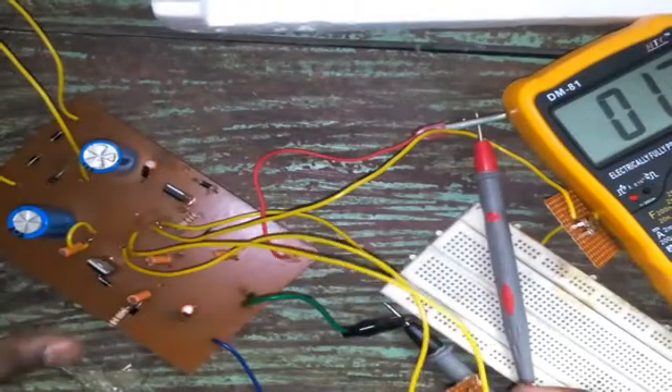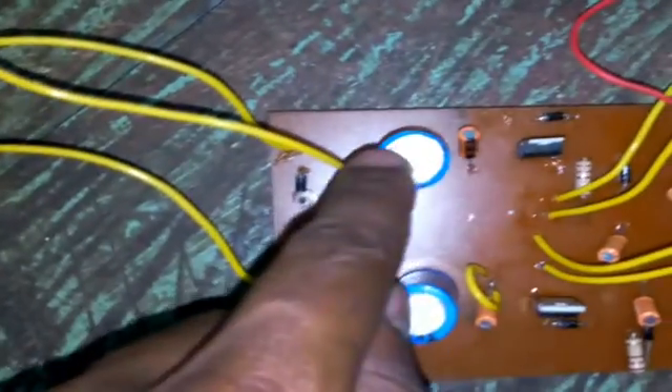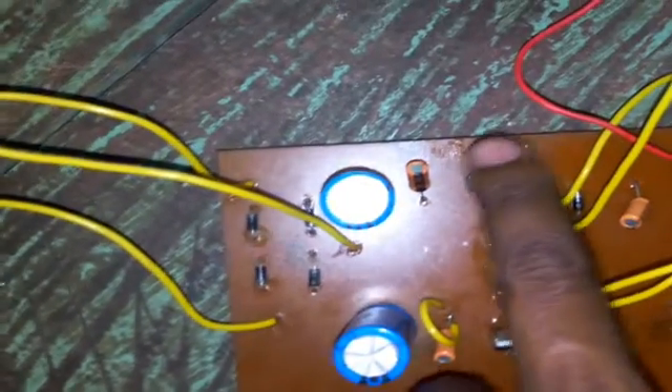As I explained in the last video, this is a practical output of a dual power supply project. This PCB section includes four diodes and two big 2200 microfarad capacitors comprising a bridge rectifier. You can see two ICs here: the LM317 and LM337 linear voltage regulators. The other main part of this circuitry is a 12-volt center-tap two-arm transformer.